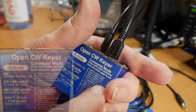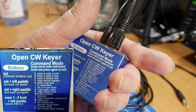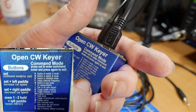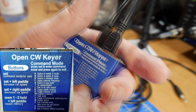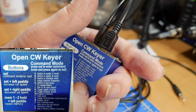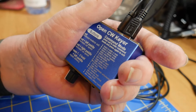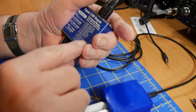Now, I recommend mode B. The side tone frequency is that frequency that you hear there, okay? Transmit enable, disable if you want. Dot-dash ratio adjust, you can adjust it. If you do that, I'd make the dash a little bit longer, just a little bit. Toggle paddle reverse, if you're left-handed or something, you may find it easier to flip the thing over or toggle paddle reverse.